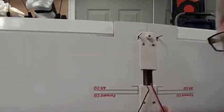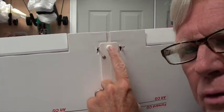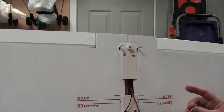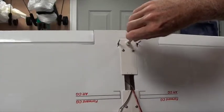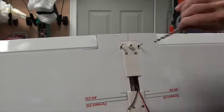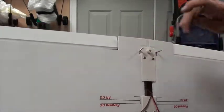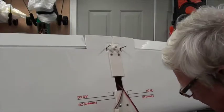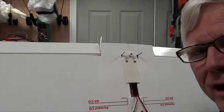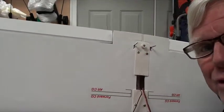Found another problem: the hole that the wing bolt goes through isn't clear. This is actually 15/64ths and it should be a quarter inch. Even the 15/64ths — you can spin it but there's a blockage. If you try the quarter inch, it'll barely go in but hits the same blockage and won't spin around it. So I'm going to clear the blockage — I'm not sure if it's the plastic or the wing catching on something — but the bolt won't go through right. I ended up using both the 15/64ths and the quarter-inch drill bit, and they both go smoothly now. Whatever was blocking it is no longer there.